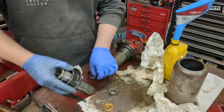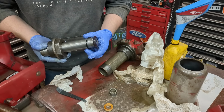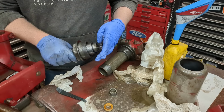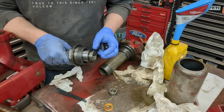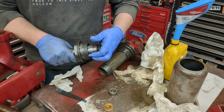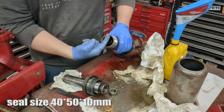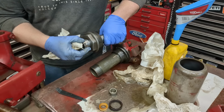Okay. Same with this one down here. If you couldn't find seals, this is just another U-cup seal. You would wait, right here. It went just like this. You would measure. It fits over that lip. You would measure this step inside right here because it seals against this little inside step. And then you would measure the outside bore, which is, 2 inches or something right there. And you would order a U-cup seal that way to make sure there's no burrs.